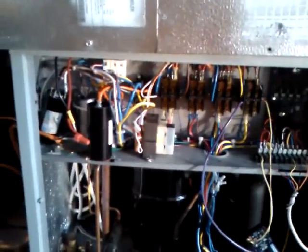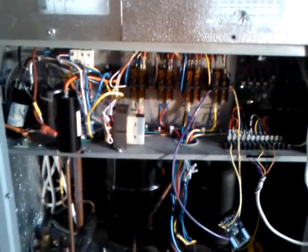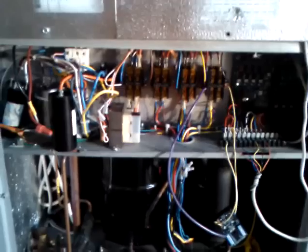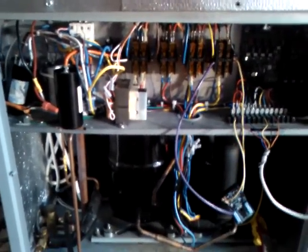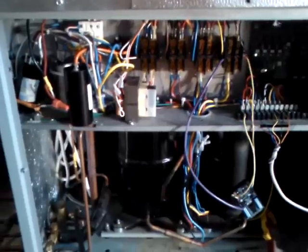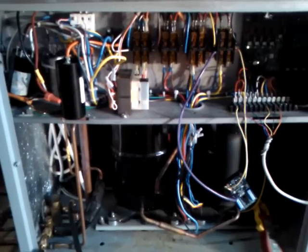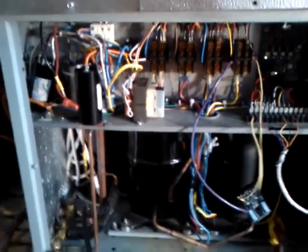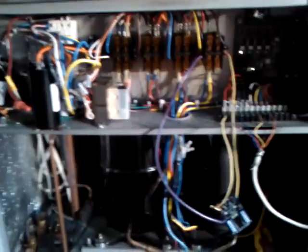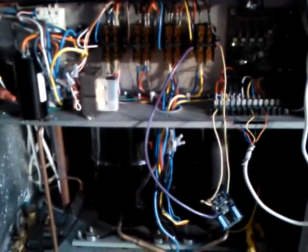I'm testing a UMSR-50 potential relay. I took out the dual relay setup — this had a dual contact, dual relay setup which was spec'd by Bristol Compressors. This is exactly how they told Hallowell to set up the T-81 compressor when they switched from the T-89 to the T-81. And it fails. I am convinced that Bristol single-handedly put Hallowell out of business because of this setup and the high failure rate.